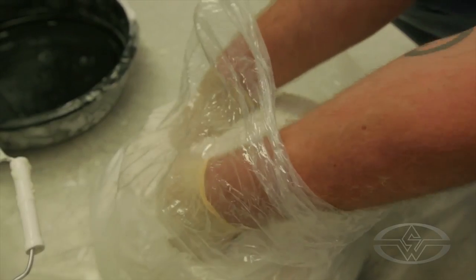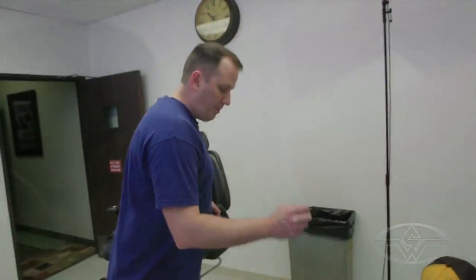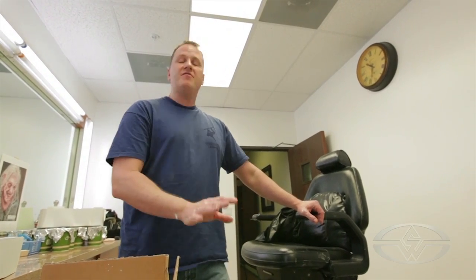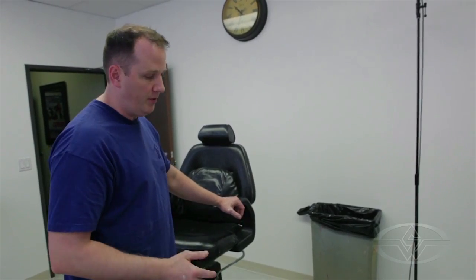You always add your powder into the water — always. You don't do the reverse. This is very different than alginate; even though it looks the same, it's a completely different material. You never want to confuse the two — you never want to mix up HydraCal thinking you're mixing up alginate. So be very organized and careful about how you separate the two materials.